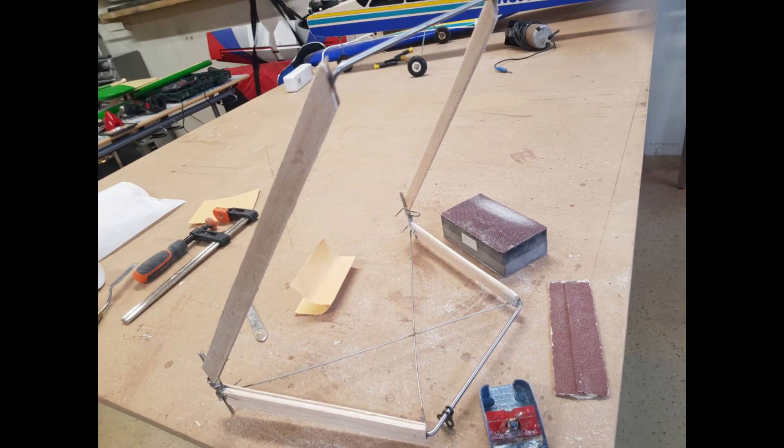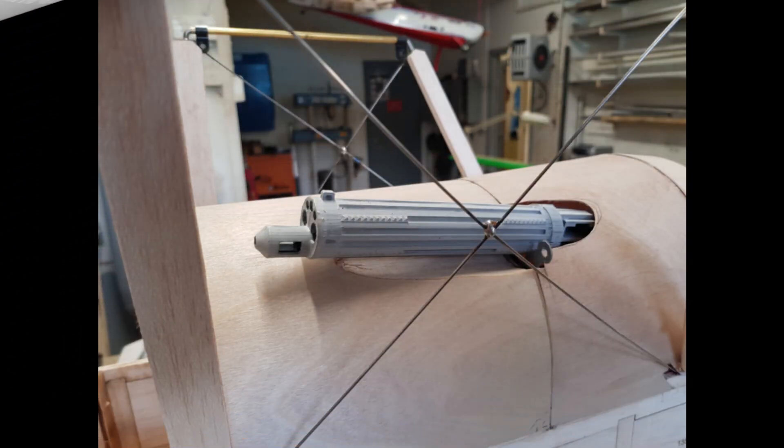Day 42. Short day today. I formed the balsa on the landing gear using sandpaper, a plane, and a sharp knife. While I still had the room, I opened up the slot where the Vickers machine gun fits and then widened it until the gun slipped in. Now I have to add a small wall around the gun and a piece of plywood covering on top of it. I will have to be able to fit the gun after I have covered and painted the model.